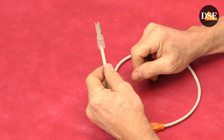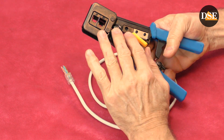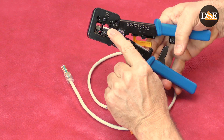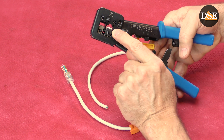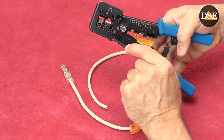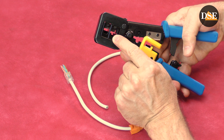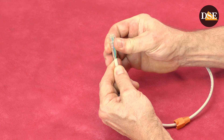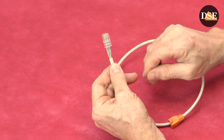Now it's time to crimp our connector. To do that, we use a crimping tool — this is our special clamp for pass-through connectors. As you can see, it comes with a blade that cuts the wires during crimping. If you don't have this special tool, do not worry — you can use a standard clamp; the only difference is that you have to cut the wires with scissors after crimping. We must insert the plug into this hole. Before doing that, we recommend you move the connector to the top of the wires. In this way, there will be no chance that some wire remains stuck in the clamp and will not be cut.